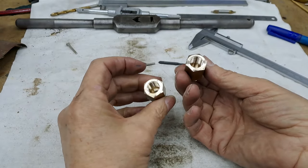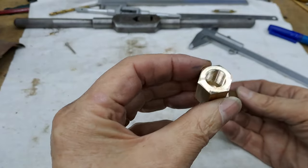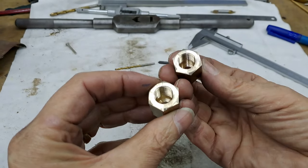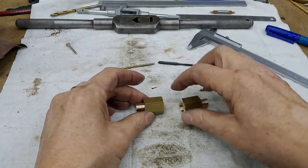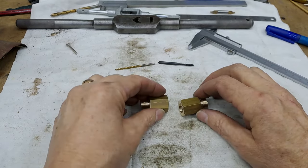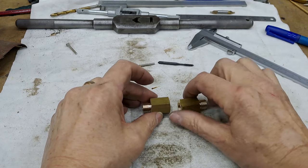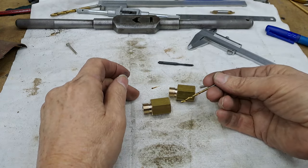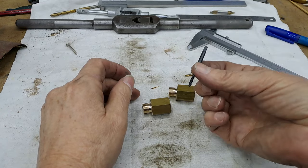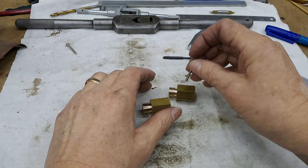One with a drill bottom. That's the drill bottom one. This is the flat bottom one. Only operation remaining now is we need to, at the specified distance, the drill bottom one is 17, I think, and the flat bottom one is 11. We need to drill 2.5, tap M3, and then these are M3 rounded bolts.